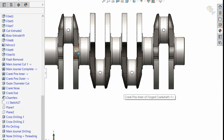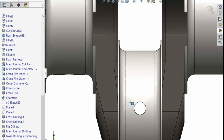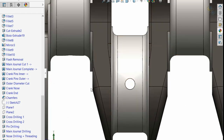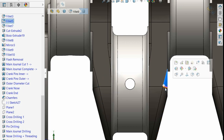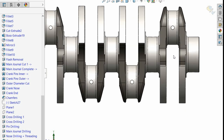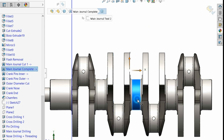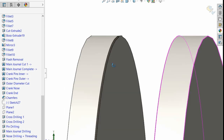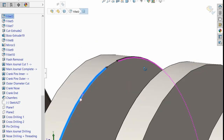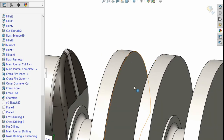They're not perfect. The spacings between all these operations are perfect, but the crankshaft might be in or out by a millimetre or half a millimetre or something like that. You know what I mean? Look, you can see it here. All these journals are exactly the same diameter. You can see there that this line is nearly to the apex there, where this line there is miles away, right? This happens. You'll see it in crankshafts, where it's not entirely perfect, right? The journals are, but where it cuts out, there's another example. You can see that we've got an edge there. I haven't done this. Look, you can see we've got an edge there, right? And on this one right next to it, it's tiny compared to that one. It's just offset. You know what I mean?